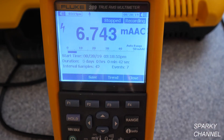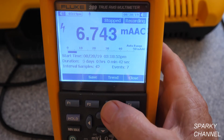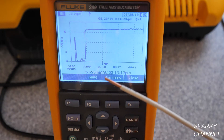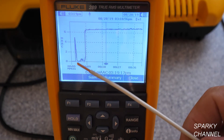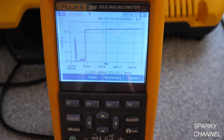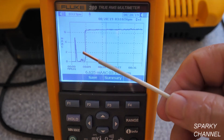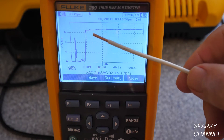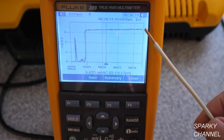Now we're going to get the trend graph. Press F3, the button right below Trend. You can see it starts slow — this is circuitry built into this particular battery charger. It starts up and then a damper comes on and keeps it low. This is to prevent spiking at startup; startup amperage can get up to 11 or 12 amps for something like this and can cause your circuit to blow. This is a very nice unit — it includes that dampening, and then the amperage comes up and runs at about 6.7 to 6.8, nice and steady, maybe increasing ever so slightly.